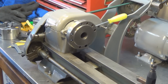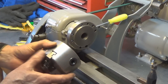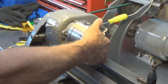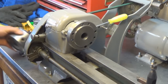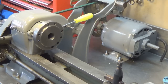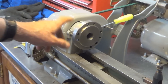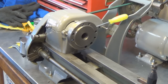I've done my first bit of machining and it took a little while with some trial and error. As I showed you before, these two pieces didn't fit together — now it's a snug push-on fit, and that's what I want. I can now screw it together and make it a permanent unit. I learned that one of the things I had to do pretty quickly was push my motor back and tighten up the rear belt, because it wanted to slip when I started grabbing. A couple of times it actually stopped the lathe head when the bit dug in, but after tightening the belt I didn't have that problem.